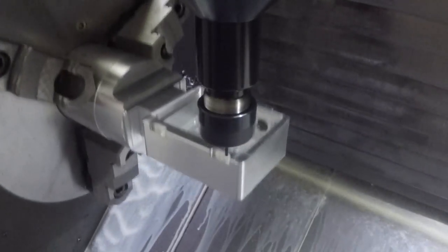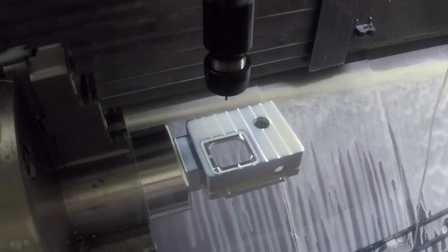I had to set up a sixteenth-inch end mill here. I was a little leery about running it without coolant, so I have coolant on it — it's kind of hard to see what's happening, but it's just reducing the radius further in those hinge pockets. Then we go to the front of the camera and finish out the through-hole where the GoPro bezel fits. There's a little face seal recess groove that the GoPro camera's case had, and it machines that for the rubber seal. I just took the dimensions straight off the GoPro case for that.